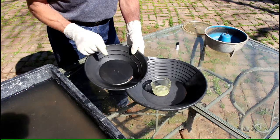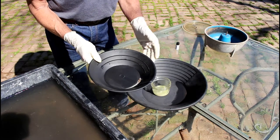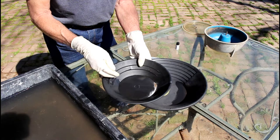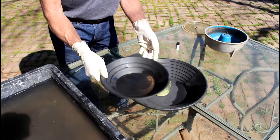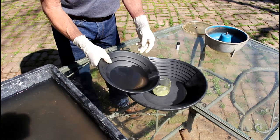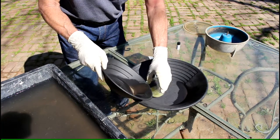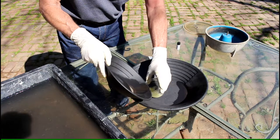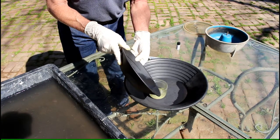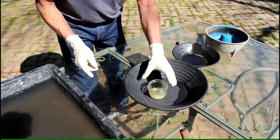What we have left here is our gold, and there's probably some lead in there too. Take a little bit of water, pour it on there — in a small quantity like this it will neutralize that acid quickly. Then take that small amount of water and pour it in with the rest of the acid. Now we have our gold — make sure we get all that acid out of there.